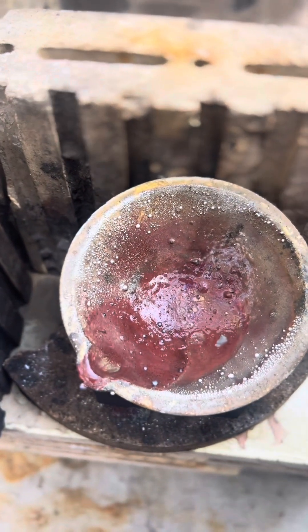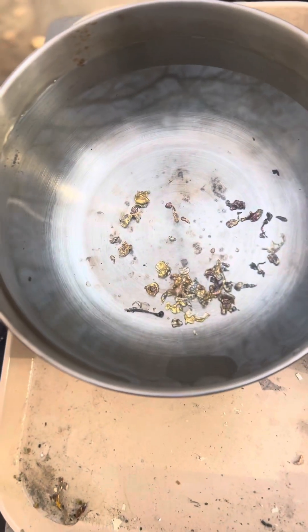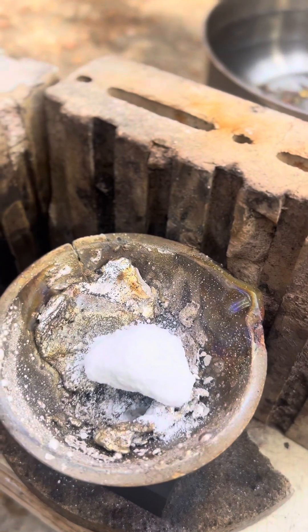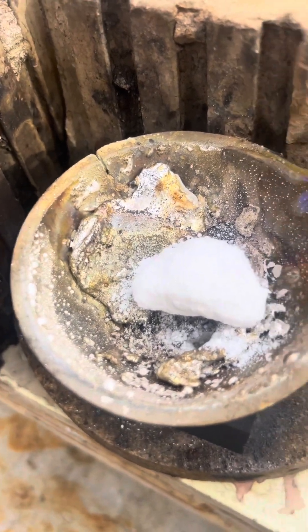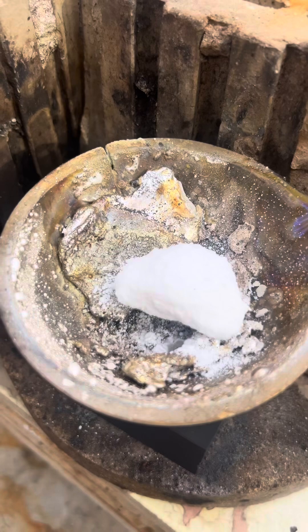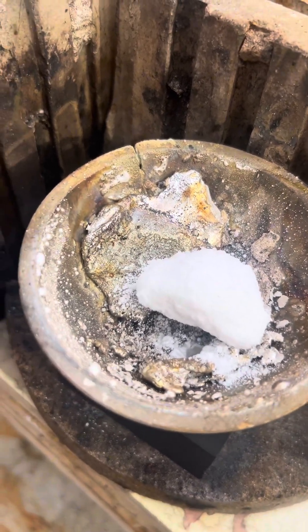I'm gonna cast that into some smaller grains — these are the kind of grains I like. I put a piece of borax in it so it won't blow out when I heat it up. It wasn't sticking together and I had to put my respirator on because I was producing more fumes and I'm downwind of it. So here we go, we're going to go back at it.